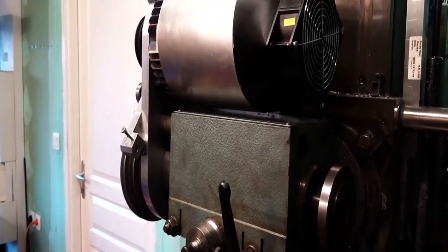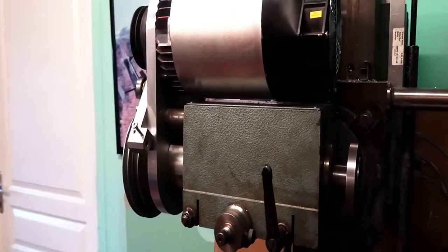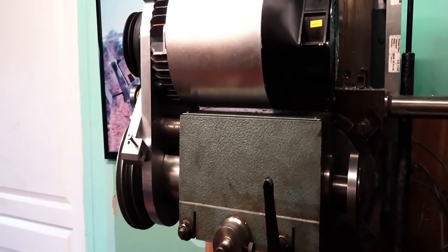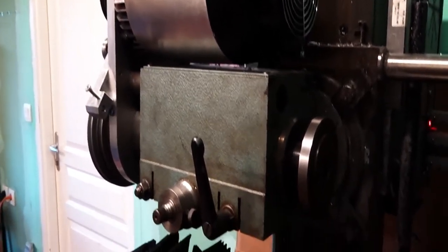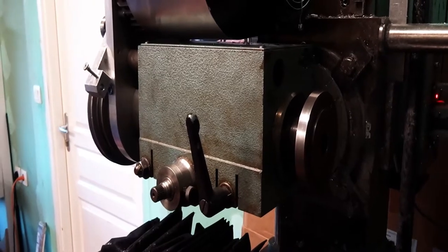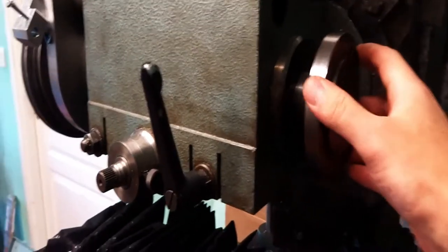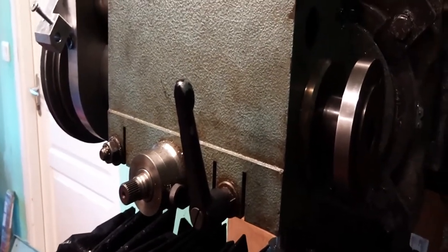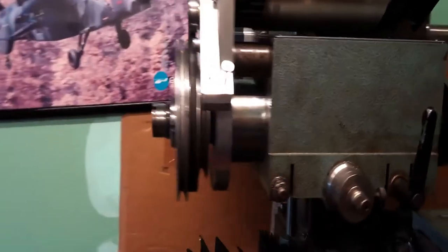And one thing I can notice, you can't because I didn't show you previously what the sound was like, but it is so quiet now. It slows down quite fast. You can see at the end that it injects some direct current to stop the motor. So it doesn't have any braking resistor, but still it slows down pretty fast.